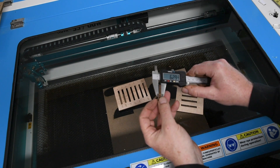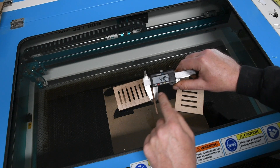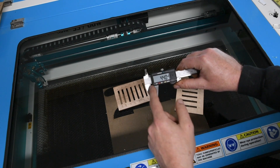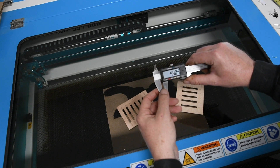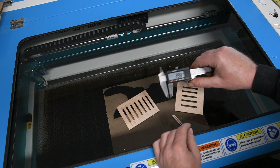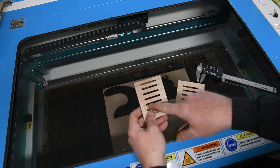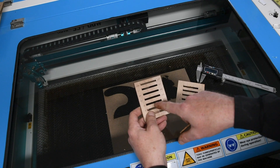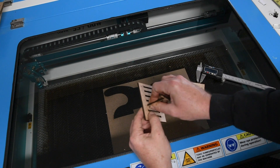When you're using the calipers you haven't lost that material yet, so you have to account for it. When I measure the piece at 4.4mm, I subtract 0.2 from each side, so instead of cutting at 4.4mm I cut at four millimeters. Then when the laser cuts and removes 0.2 either side, that's going to give me a nice tight fit.